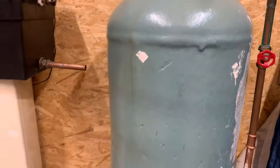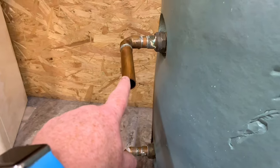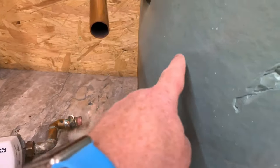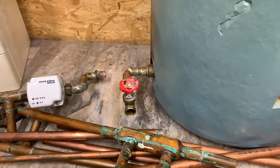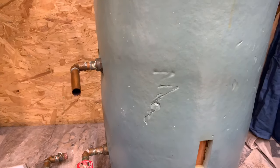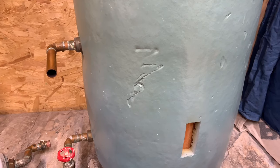On the other side we've got two pipes - the flow and the return. Heat from the boiler comes into the flow pipe, goes around a coil inside the cylinder, transfers the heat into the cylinder water, and then comes back out at the bottom colder. That return goes back to the central heating boiler, which pumps it back continuously, heating the cylinder. A control then shuts the boiler and pump off once the cylinder reaches the set temperature.